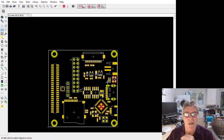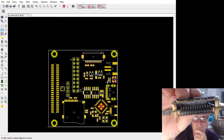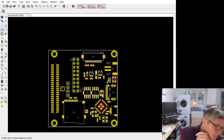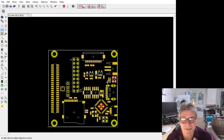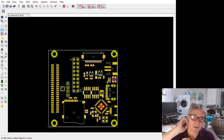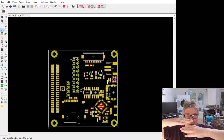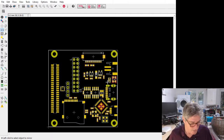So for example, when I was showing that motor board earlier, the gap between here is about 7 mil, somewhere between 6 and 7 mil. So you have to watch the height of the components. The electrolytics that I've put on to that motor driver board are 6 by 5. So they've got a diameter of 6 mil, but they're only 5 mil high. And that ensures that there's enough room if the board is reversed so that those components are sitting in between the tile and the carrier as part of the sandwich.